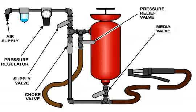As you slowly open the valve, you will see media exiting the nozzle. Too little media will be an intermittent flow that is useless for blasting. Too much flow will flood the line with media, causing burping, which is at best annoying and a waste of air. For most work, you will want to sneak up on the right flow, which is slightly beyond the point where the nozzle sounds like a spitting cat. The most useful will be a steady hissing sound with a steady flow of media. You can have this hissing while still flowing too much media, so the best method of adjustment is adding media until it is functioning properly and stopping there.